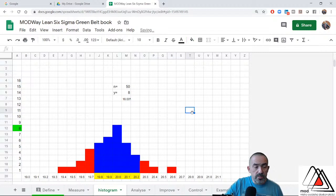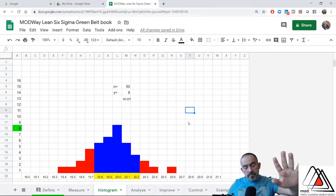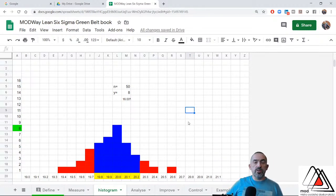So now we should worry. The red shafts which are too short may not be used for another product, so we have to throw them away. The longer shafts, there's probably a chance to rework them a little bit and make them short enough to use in the product. So anyway, everything we have to scrap and throw away, and everything we have to rework, is additional cost. From the Lean Six Sigma perspective, it's a waste.